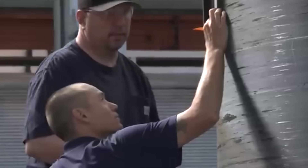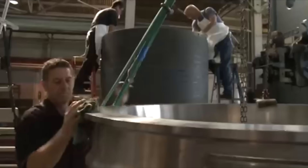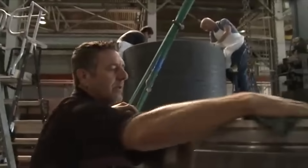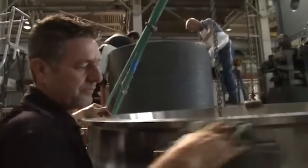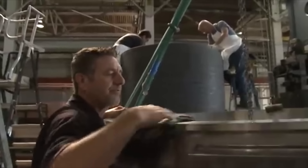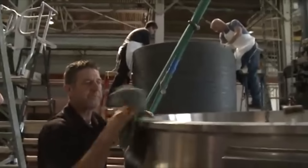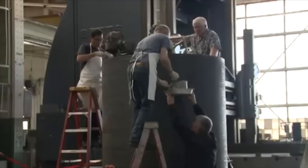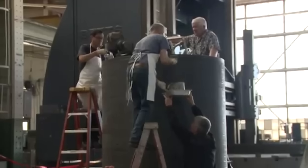Between the two components, really what's holding them together and allowing them to move together is the glue — you want nice, even movement. It's the glue that's holding the family together and we want to make sure it's right. Now before we look at the glue itself, let's be absolutely shocked at how this technician is cleaning the titanium component prior to bonding. In his right hand we observe a dirty rag which he appears to be degreasing with, while simultaneously touching the component afterwards with his ungloved left hand. It's a huge no-no to touch composite components prior to bonding with your bare hands because you can introduce grease, which is going to really sabotage the bond — especially when bonding dissimilar materials like titanium and carbon fiber.